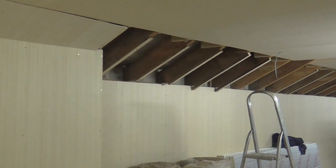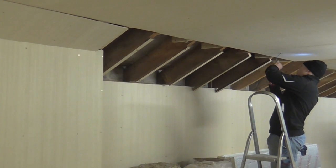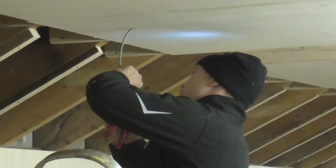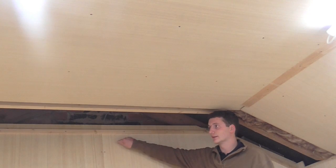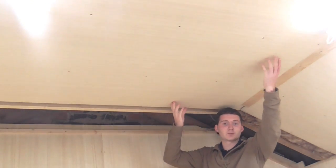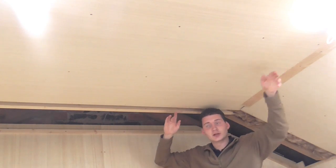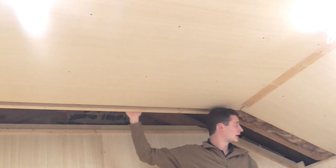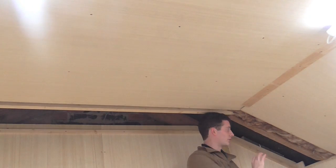Just before I finish insulating the ceiling I've decided to rewire all the lights and I've got George here helping me — you may notice his USB chargeable woolly hat with a built-in USB light. Thank you for your help George. Roof insulation is nearly done now. I started at the far end and I'm nearly at this end. The method has been to screw one sheet up at a time and then reach in over the top and lay the insulation down. With these being four-foot-wide sheets you can just about reach all the corners and check everything's flat before screwing the next board up and repeating the process.